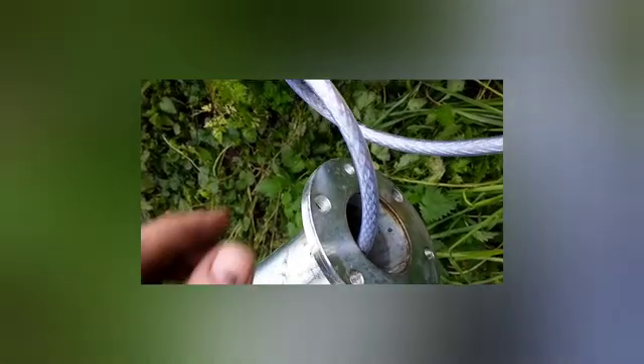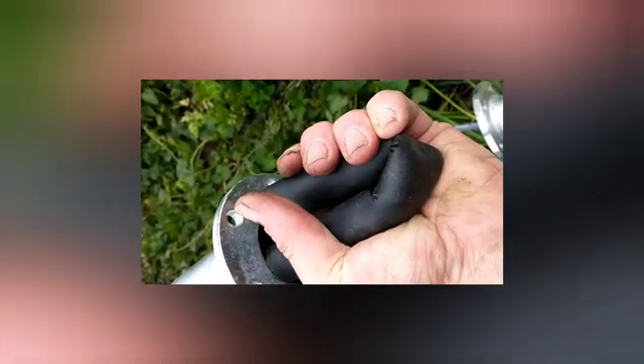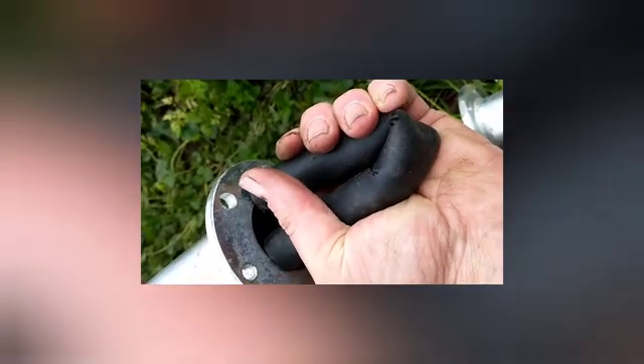I had to change the cable as the previous one wasn't long enough. The strain relief for the cable is to put a twist in it, and then put a piece of black three-quarter inch pipe and push that down into the tube, so that the cable is stopped from pulling on itself. So the black pipe is a wedge with the cable looped around it, which is the strain relief.